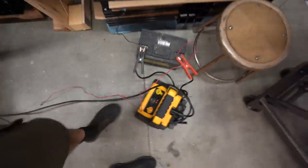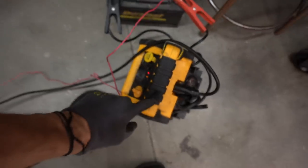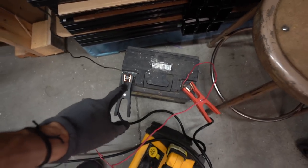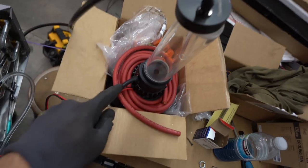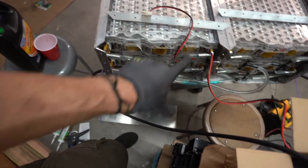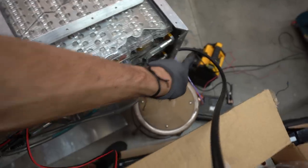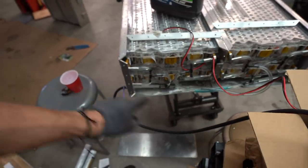It is time to test the cooling system. I've kind of jerry-rigged this fun experiment. I've got a car battery — it was actually really low voltage, pretty dead — so I'm charging it up. This is giving me just over 12 volts output, which is what I need to power this PC cooling pump. It goes out into the input and then through these pipes. And the output goes back into the reservoir, which will be full of coolant — antifreeze. I'm going to fill up that, start the pump, and just check that it's all working properly.